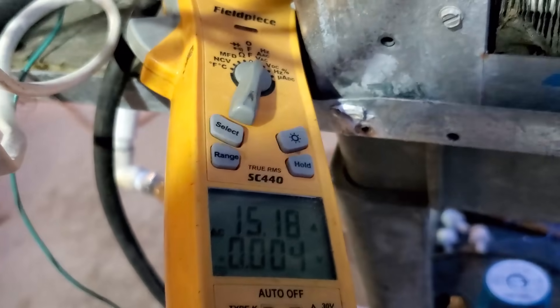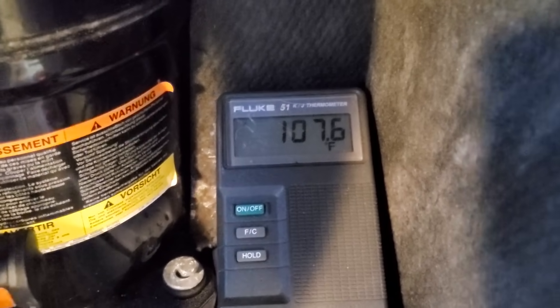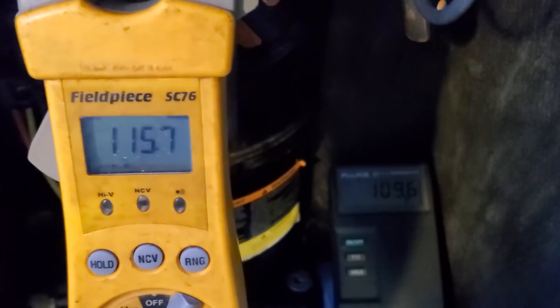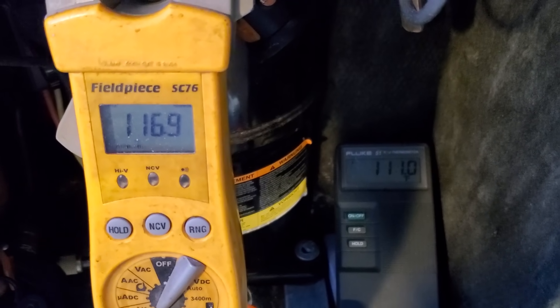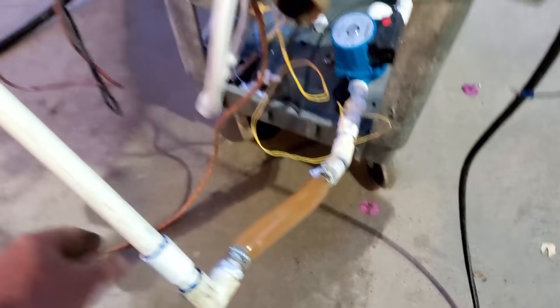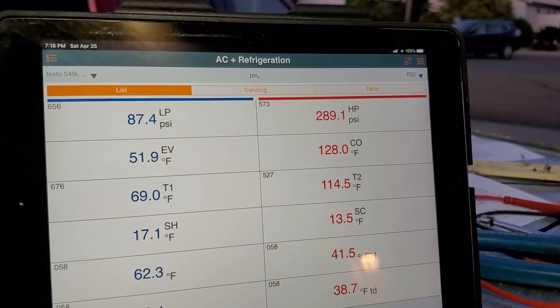15 amps — more than I used to get it seems. Tank is already at 107°F and leaving water is at 114°F — less than 10 degrees of split there. The probe reading is in the water so it's more accurate; the clamp on the copper has a slight delay. Temperature is climbing fast: 109, 110, just going up like crazy. 10 gallons of circulating water, already gone from mid-80s up to 117°F. Hopefully all this holds under city pressure — but satisfied with that pump, it's moving a good amount of water.